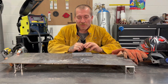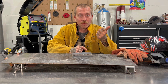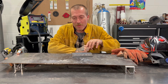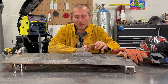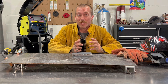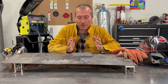Now that we have a visual example of what extreme porosity looks like, remember that if you're having this problem it's caused by either your backing gas not flowing correctly, a problem with your torch or regulator, it could be set too low, or you could be straight up out of gas. Or you may have contamination on your metal, in which case you need to get your steel brush and clean it up really good. If you're stick welding and seeing something similar, it's because your rods have gone foul — you've got to get yourself some new fresh rods that are nice and dry. So when you see this kind of stuff, know that right away you're going to have to make some sort of an adjustment.